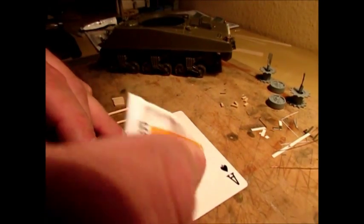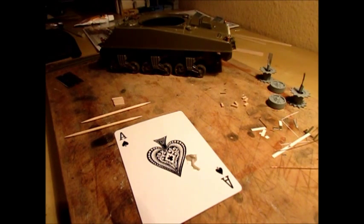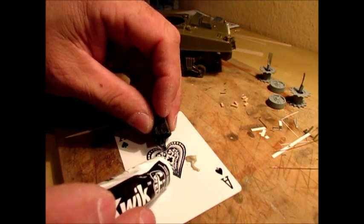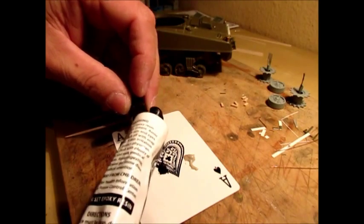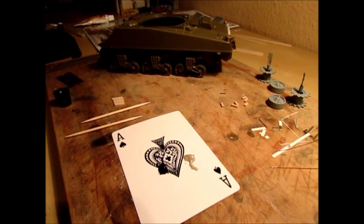We put a little dab of hardener. Be careful not to squeeze too much. And then we put a little dab of the liquid steel. Kind of equal parts. You want to put equal parts. Nothing will happen if it just sits there, as long as you don't mix them. Once you mix them, it hardens like steel. And what you want to do is get all your stuff ready, everything that you're going to glue, have your wood ready, everything.